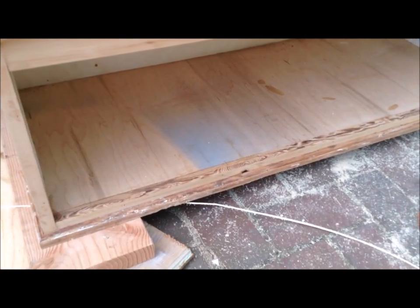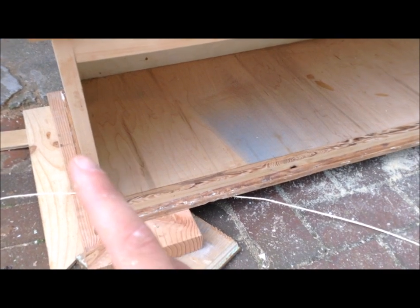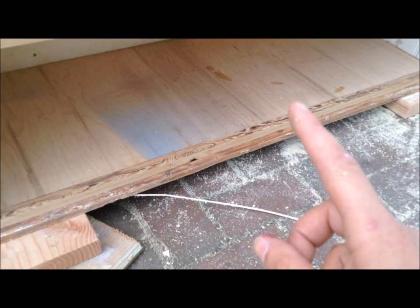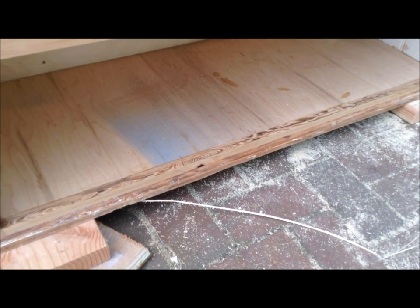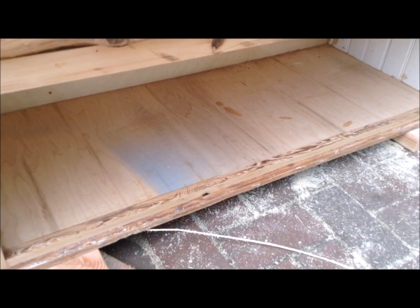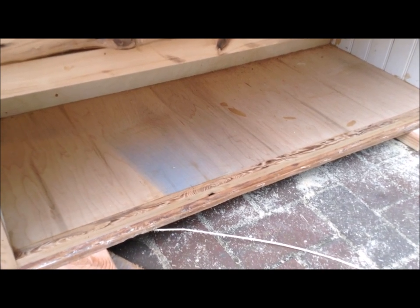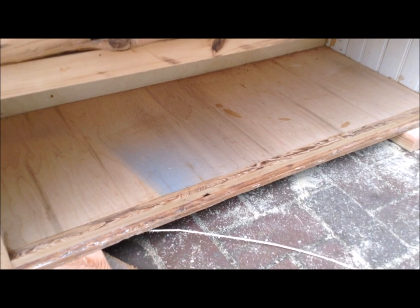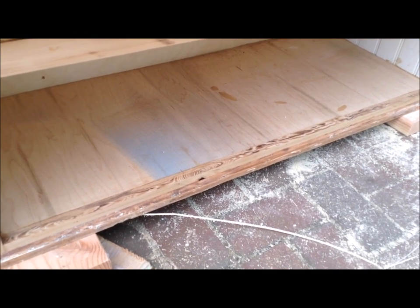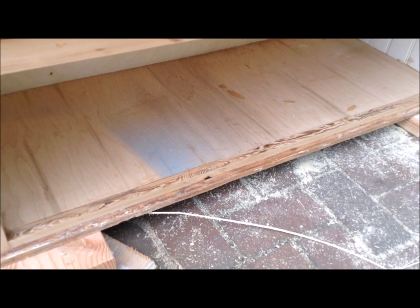So I found my halfway point. I added 3/8 of an inch to my measurements on this side, the top and the bottom. In the middle, I don't have to because there's no partition. And I'm going to start making those. I'm not going to be describing it in detail because I already have a video on my channel of how to make partial inset or partial overlay doors.